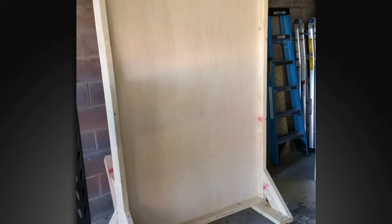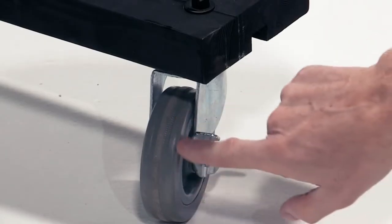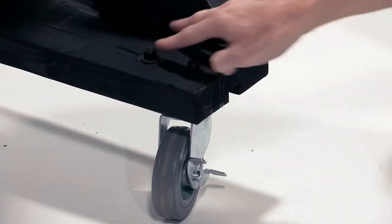Back to the story. After the legs were assembled, you could stand it up and kind of see where this thing was going, but by this point it was so heavy you wouldn't want to. So next, I went to Northern Tool and bought a bunch of heavy-duty, non-marking wheels for about $10 each. I placed the wheels where I wanted on each of the support feet and marked holes to drill all the way through the wood so I could bolt the wheels on. I used washers and lock nuts to make sure they never get loose.